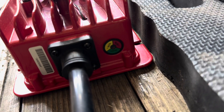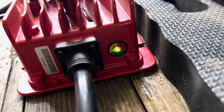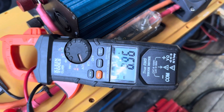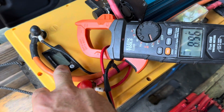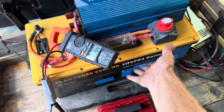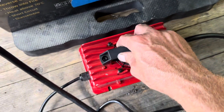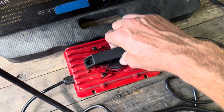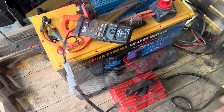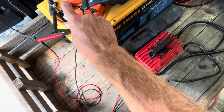Here's the indicator — you can see the flashing. They activate the red and green LED together to give you that yellow indicator showing the battery is above 80% state of charge. So you start getting that flashing once you get above 80%, and the charger also starts tapering current once it gets to the higher state of charge level. Just like it's supposed to do. The battery is almost all the way full, so I'm going to try to catch the current taper and the voltage for this charger's algorithm. When I reconnect it, it jumps up to 14.6 volts with current at zero — so it was full, and it shuts off because we're at 14.6 on the battery, then drops back to resting.